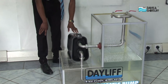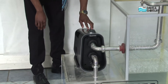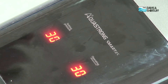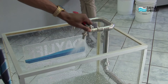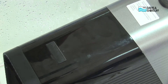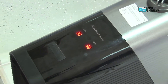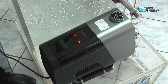Right over here we have a control panel. On this control panel you have a power button where you can switch on. Once switched on, you can see the pump is factory set at 3 bar. Let's run our pump by opening an outlet, say a tap. Now in your domestic setup, this pump is pretty much silent — very silent at about 60 decibels. For context, the humming of a fridge is about 40 decibels. So this pump is very silent and suitable for domestic use.